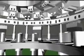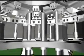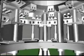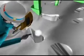Once the vacuum vessel assembly is completed, the leaf spring type vacuum container supporter and 12 bottom vertical ports are lifted from the Tokamak pit and assembled by welding. Then the vacuum vessel is finally settled down.